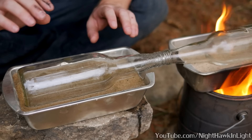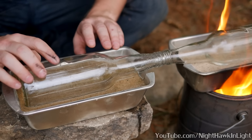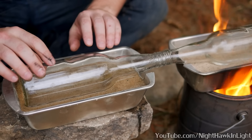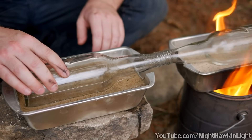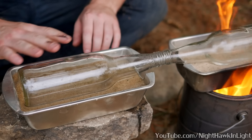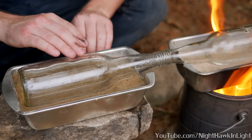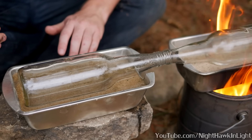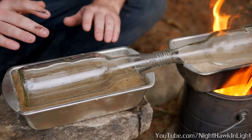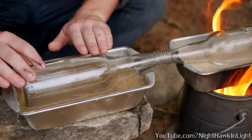It may be a little bit difficult to see on camera, but there is already a significant quantity of distilled water collected inside of this second bottle. What I'm doing is continuously rotating this bottle, since I am not using a damp rag over top of it to cool the top half. Instead, I'm rotating the bottle so that as the top portion becomes hot from the steam, it's rotated into the cold sand below. In that way the entire bottle maintains a cold temperature, which causes the distillation to go much faster.